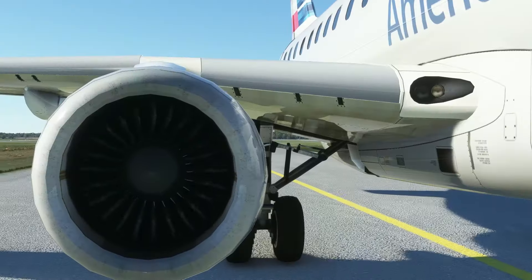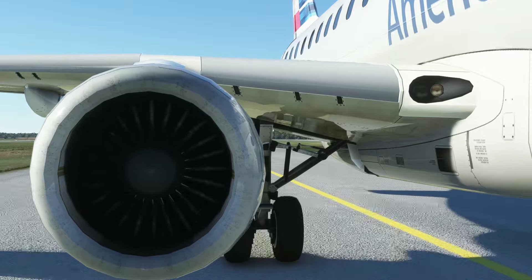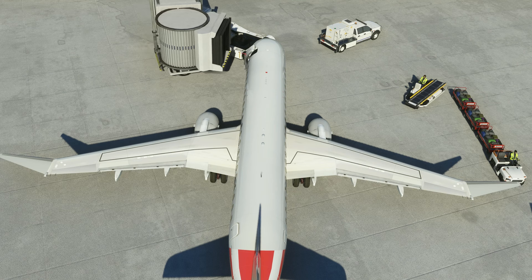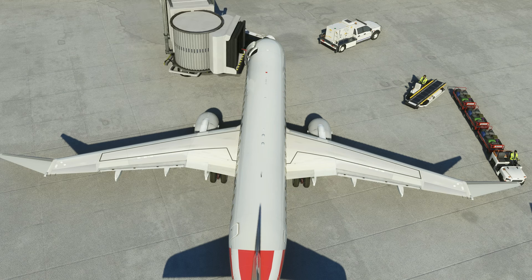So there's a lot of communication going back and forth. When an airplane's APU is not working, they'll taxi in on one engine — usually the number one or left engine, but not always. The flight crew can choose the number two engine if they want. When they are marshaled in with wing walkers and the lead marshaler, he'll bring the aircraft in like normal and stay outside the safety envelope. It takes a few minutes, but the jet bridge will be moved into position and the ground power unit, or GPU, can be plugged into the plane.